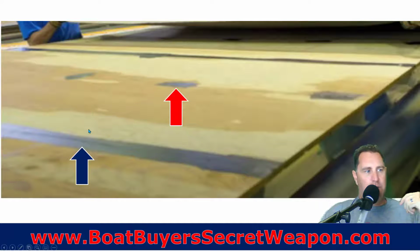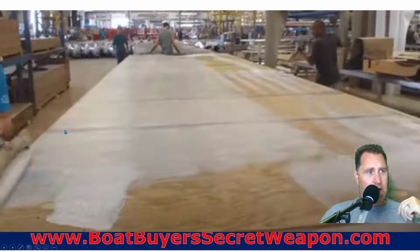And then we're going to waterproof all of those seams, okay? So you're going to waterproof anywhere there's a screw going through, anywhere there's a seam, and that's an adhesive and a waterproof material. Now it's time for the flooring. So we're going to put down a nice, good adhesive that's waterproof again. So another layer of waterproof protection on the top end.